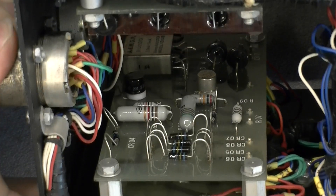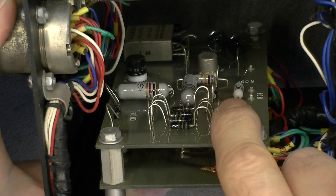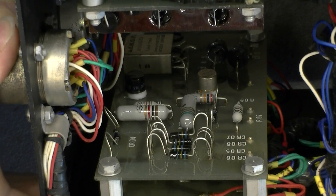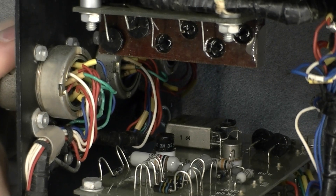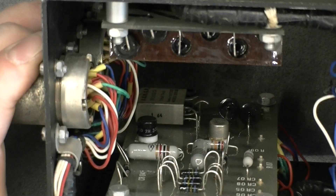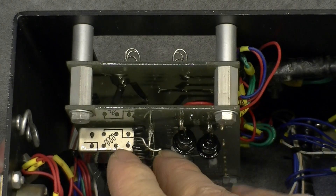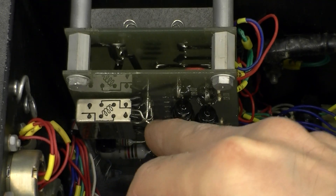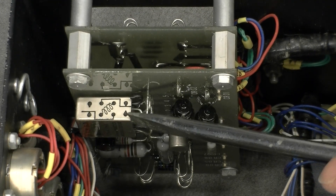There is nothing else on this PCB, but here we have two more or less similar PCBs with quite big resistors and a military quality stamp. All the legs were bent over, probably to dissipate some heat. There is at the back a big relay with a date code of January 1964, and some transistors - 2N338 it seems. One leg is connected to air, it seems - it is not used. They did not do anything to prevent it from vibrating loose. We have two others here, but these ones were insulated with heat shrink, not this one.